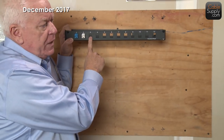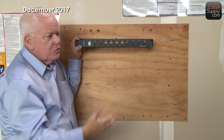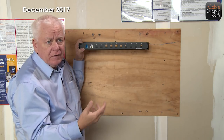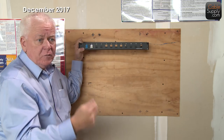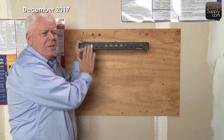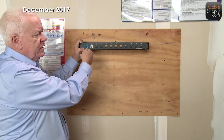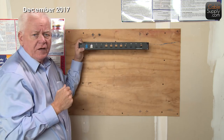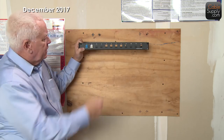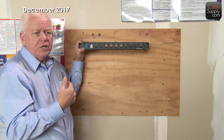You can also use any type of keystone replacement here. You can fill these with coax, or use RJ11, or even BNC — though I haven't used BNCs in years. They still use BNCs with some cameras. Now, if you're going to use an RJ11 line, I'll be honest with you: buy an RJ45 jack instead. Cable it normally for a computer on both sides, then just plug in an RJ11 — it actually will work. An RJ11 patch cord will work on an RJ45 jack just fine because the RJ11 mod plug is smaller in width but not in height, so it clicks right in. You don't need a dedicated RJ11 jack.